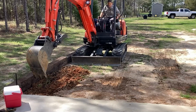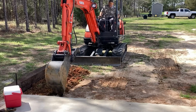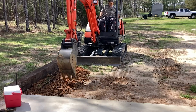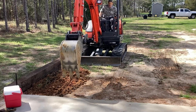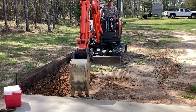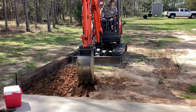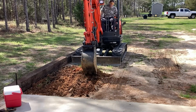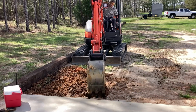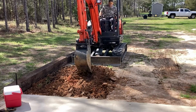After we had the patio poured, we brought in a little clay here so there wouldn't be a steep drop off as you're getting to the vehicles, but now I got to dig that out. Actually, I'll reuse it, but I still got to dig it out because gravel will go here. Because the idea is we want gravel right up against the concrete. Slopes from, I guess, the camera's right to the camera's left. So I think what I'm going to do is dig this out, box blade it out, get this dirt out of here, and then lay the road down and crown it, and then watch and see where the water comes down the hill. I think we're gonna have to put a pipe right here where I'm digging now. But I don't want to dig too deep.